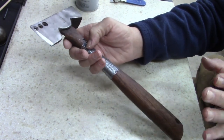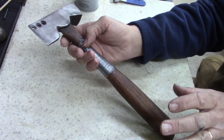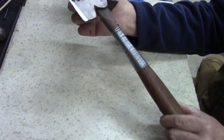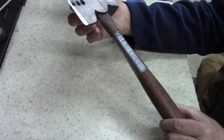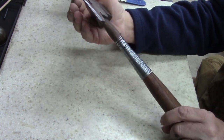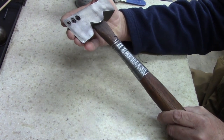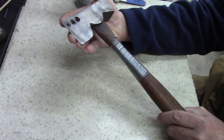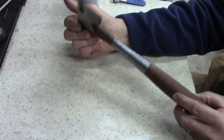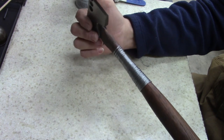And you got to remember the facility I'm in is a fire rated facility, so there's no wood construction, so it's steel studs, 26 gauge, 20 gauge, depending on ceiling height. There's a lot of factors. Anyways, I could use this to rip out some of that lead lined sheetrock. And mind you, a 4x9 or 4x10 sheet of 5/8 fire rated with leaded sheetrock weighs around 400 pounds. The weight can vary depending on how much lead's on the back, how thick.